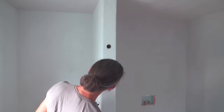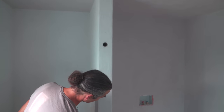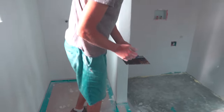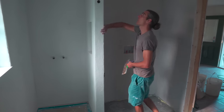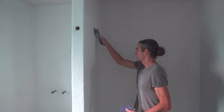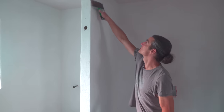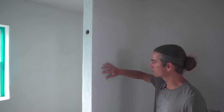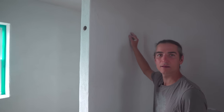So now I'm just sanding all of this, because I don't want any loose sand particles or little chunks. On corners, when you put the base coat on, you get little chunks that sort of dry on. So before the TADELAKT goes on, I scrape off any loose sand, because if I start putting plaster on it, those little dry pieces of sand get stuck in the plaster.